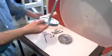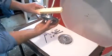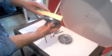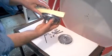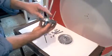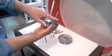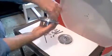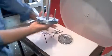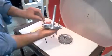Now, you'll see. You can check this with a board. So that you want those washers to be just about even with the outer pulley, so that when you tighten this down, the washers and the outer pulley are all flat, and all 3 screws are going to be pulling this tight against the wheel along with the matching washers, which I think you can see there. So you're going to need all 3 bolts, 1 washer on the outside, 6 on the inside.